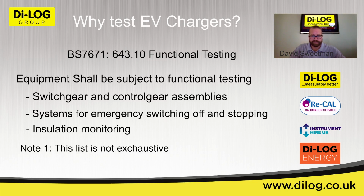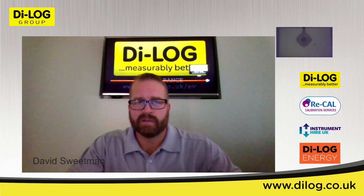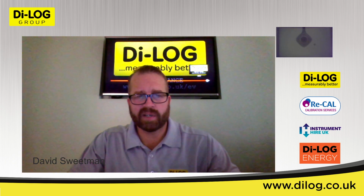So we believe, and all manufacturers are of the same opinion, speaking to some colleagues in other manufacturers who are friends of ours at Metrel, all of the same thought really, that this should be a test that is integrated into the process when testing EV chargers. And we're quite adamant that this is the way forward, and this really should be done, or at least considered as part of your installation process. So what have we done? What have we changed in our equipment and other manufacturers to actually make them into EV testers as well? So we've introduced a 6 milliamp DC, a pure DC RCD test into our latest product, which is the DL9130 EV.